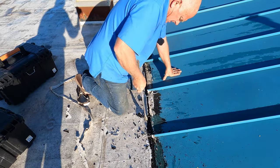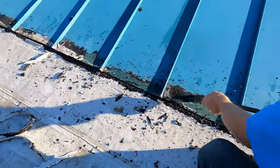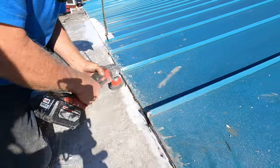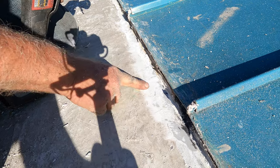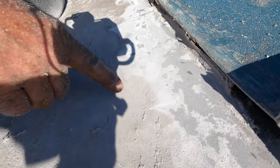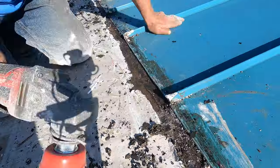You have to clean up the mesh and remove the residue. You have to remove the bulk with a flat bar. This is an EPDM roof — a rubber EPDM — and this is metal. So I go with my grinder and remove even the silicon and caulking that's on this EPDM. You have to remove it. You don't want dirt like this — the dust and dirt. You want a clean surface, so I remove the tar.